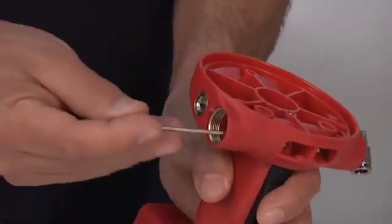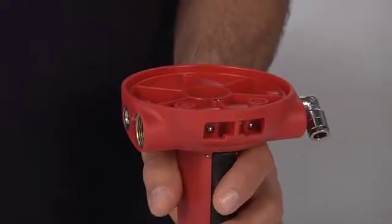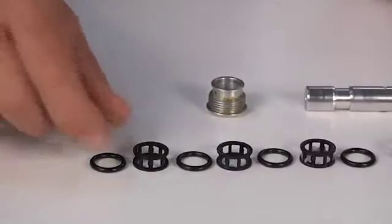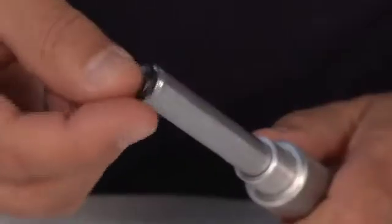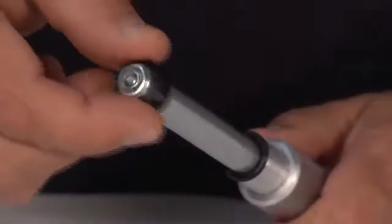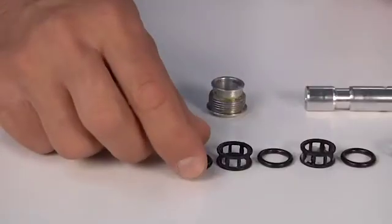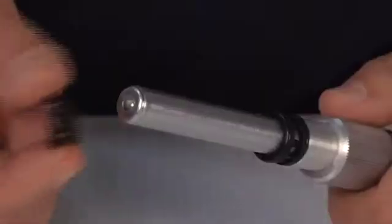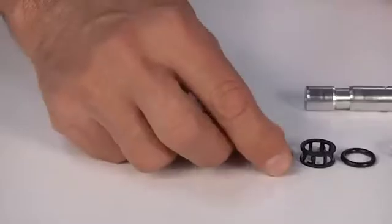Check the conditions of the coil kit housing, which must be perfect. Mount the coil kit components on the key, which can be supplied upon request, alternating O-ring gaskets and casings, as shown. Pay special attention to the 2 central casings, which must be contiguous.